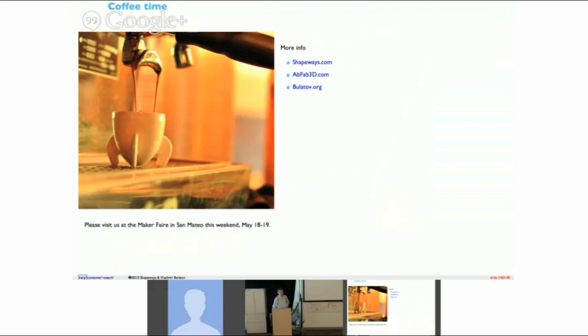So when you're working with tool steel, one of the problems is that when you sinter it, it can warp a little bit. Do you have any problems with dimensional change on tooling when you're doing the sintering? There is some percent of reduction in size, which is taken into account before actually sending the model to the printer.